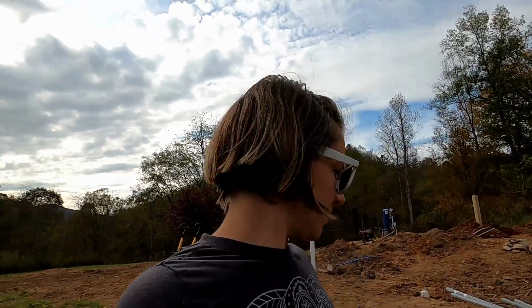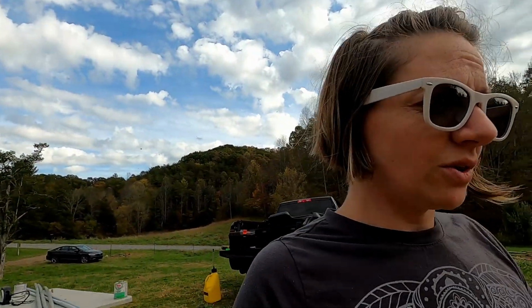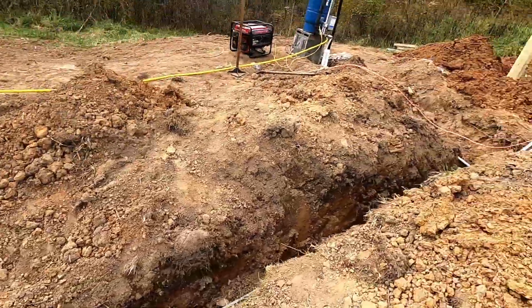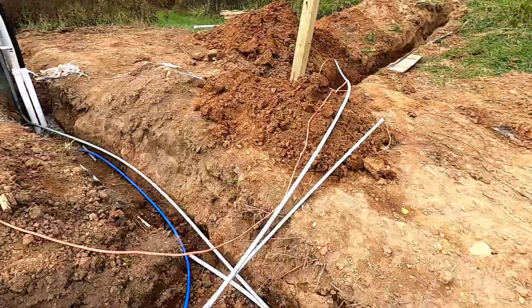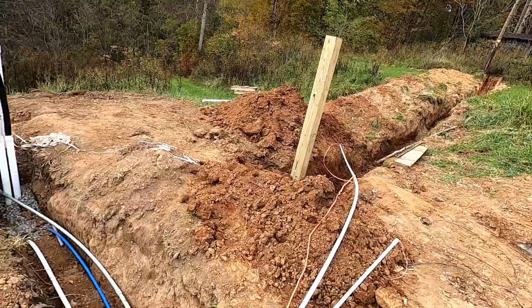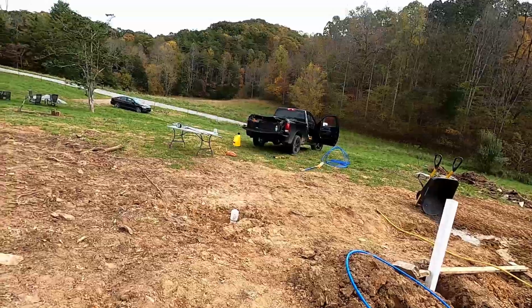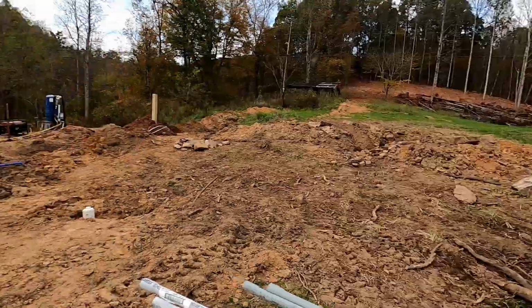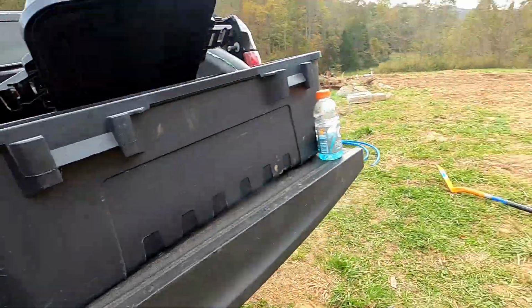I made it to the property. I've been with the girls all morning, early afternoon, teaching them because we're doing homeschool now, which is going great, by the way. And John gave me the assignment of doing the electric wiring from this pole, which is going to be for the RV power and water, up this trench. We have to dig one more trench, where these gray pipes are, to get to that wooden pole there. I have to run that wire through these pipes, attach them all together, and put an elbow on the end to go up to the white post.